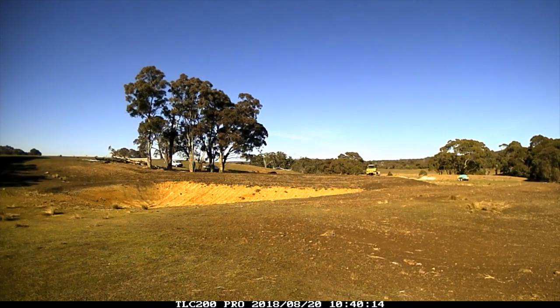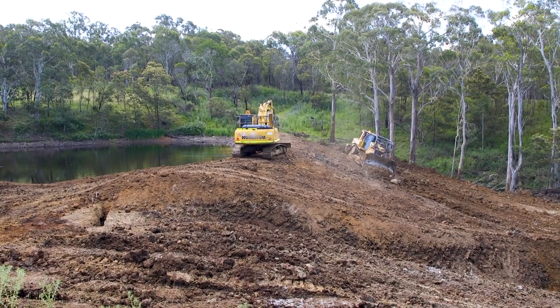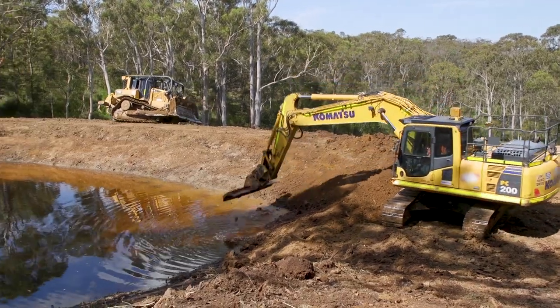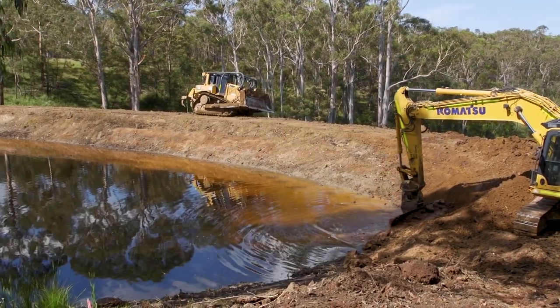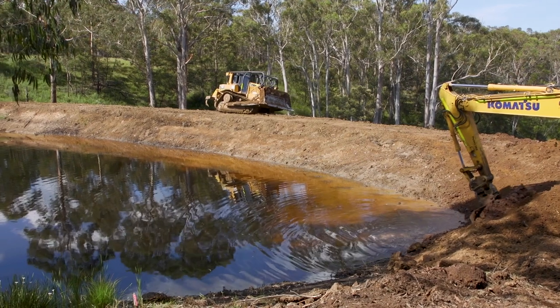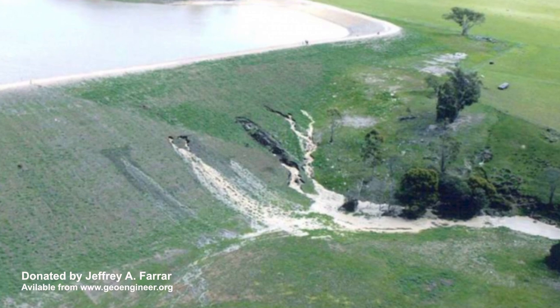When you're finished, you bring that topsoil back up over your dam so it can be grassed up in the future. If you've got a really good operator, they'll understand that you need good compaction of your soil. When they're building it, they need to be compacting that clay material as they build it. That's a key determination of whether a dam can fail or whether it'll leak.